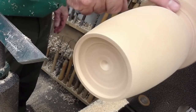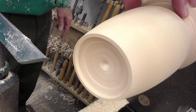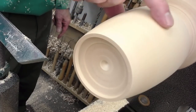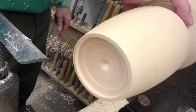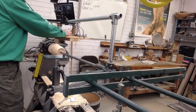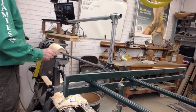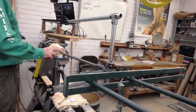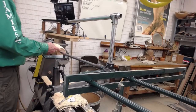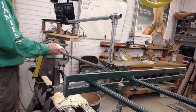I don't know exactly how deep I'm going to go here because my top's not done yet. I can't take my top down to a small vessel or it's going to vibrate, so I'm going to drill my hole short of where I think my top's going to be. Let's start hollowing — I've got the boring bar set up and I'm just going to hog off the middle first and get the material out before I start measuring the wall.